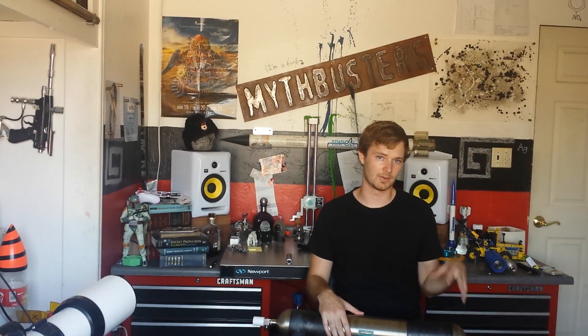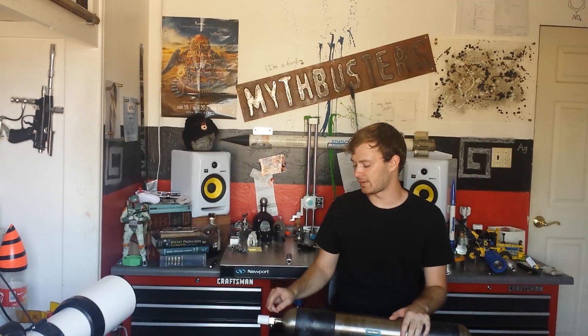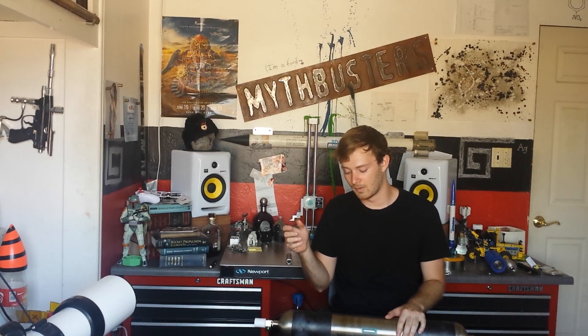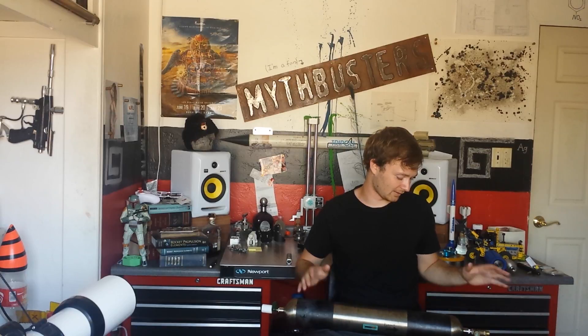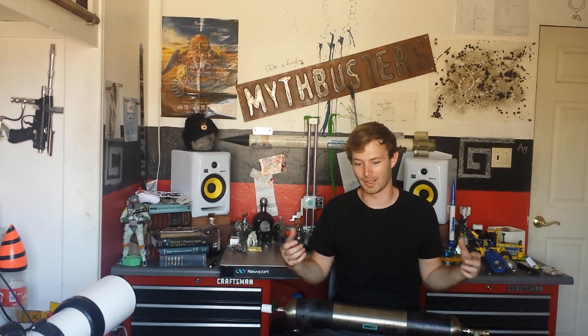Since I'm holding on to it, I kind of don't want to generate too much thrust. The throat size in this is about a quarter of an inch, so it's just a low thrust for a long period of time, so that way it's manageable and it doesn't just rip from my hands. It is a little bit of a stunt to be holding on to it and a bit dangerous, so I actually just wrap it in a towel and then I wear oven mittens.